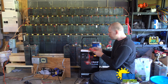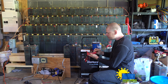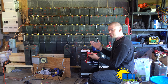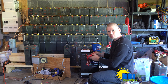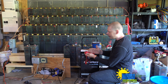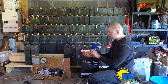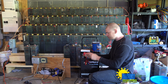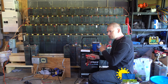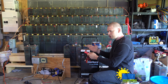This battery pack has two cells in it. If I were to stack 15 cells in series I would have an equivalent full charge of 63 volts — that's where I came in when I said 63 volts. So if I build a 15S battery pack — stacking 15 cells in series — each cell is 3.7 volts, which would give me about 55 to 56 volts nominal, with a full charge of 63 volts.